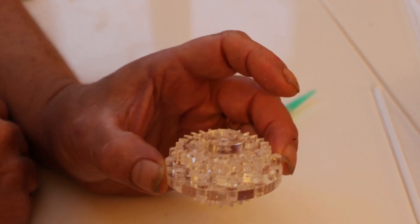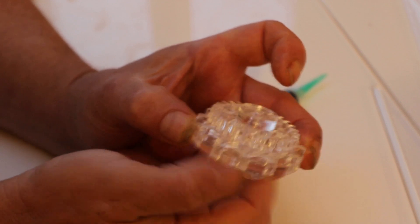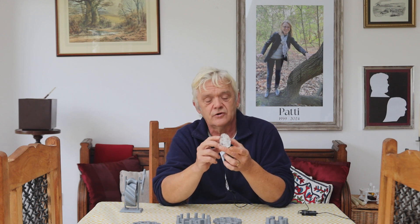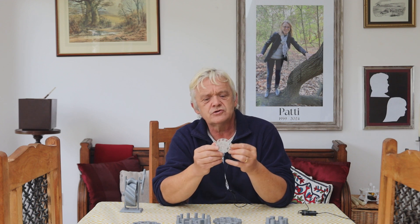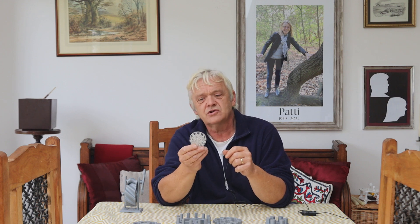What we've created is a very compact speed reducer. We turn this one like crazy and the output cog turns very slowly indeed — you can see that working there. That very compact little mechanism will give about a 10 to 1 gear ratio. To give you some idea, a 10-tooth gear would be about this size and a 100-tooth gear would be about that size to give you the same ratio — and you can get it in a little package like this. I have a cunning plan for this, so I'm going to use it in something I'm building. But I went through it first all by itself, because although I've cut this on a laser cutter from acrylic, it's identical to cutting on a fretsaw from wood — you can do this in many different ways.